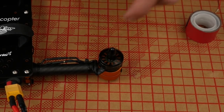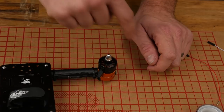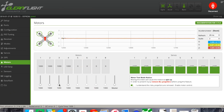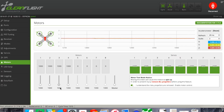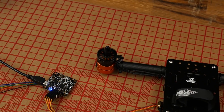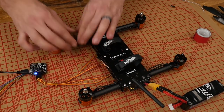Motor 1 spins in the correct direction. Check motor 2 — top right — and the direction should be spinning in. And it does. Number 3 — perfect. Number 4 is the top left — fantastic. If any of these motors are backwards, simply disconnect them, switch any two of the wire leads, and reconnect. Now that all motors are spinning in the proper directions and orientation, our next step is to set up an arming switch.